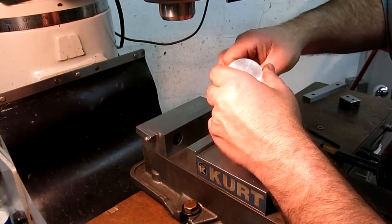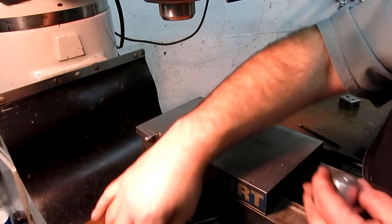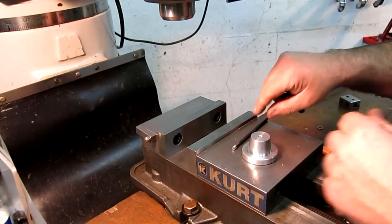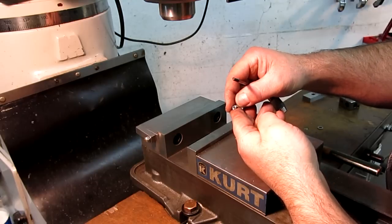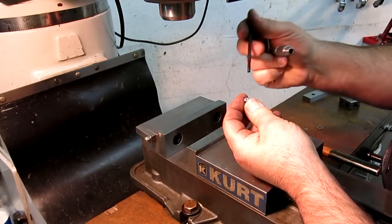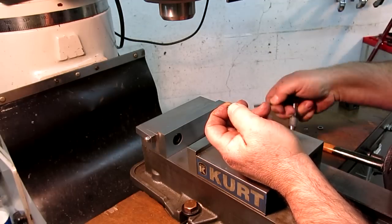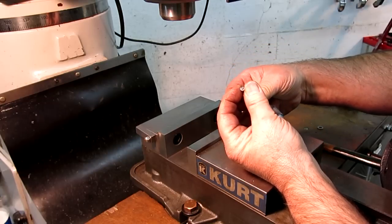So this is the helicoil tap here, and this is 8-32. And then there, for those of you that haven't installed helicoils, this is what they look like. There's a little helicoil, 8-32, so it's like a little helical spring, but it's got a little stopper tang on there. And I don't know if I'm zoomed in close enough, but there's a little notch in that, and then we're going to knock that loose with a punch. We'll take that driving tang out of there. So this is the starting tool that you engage.